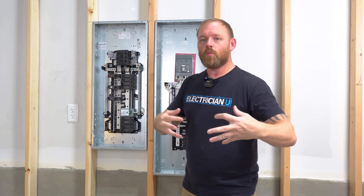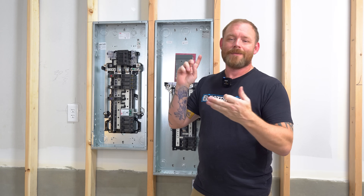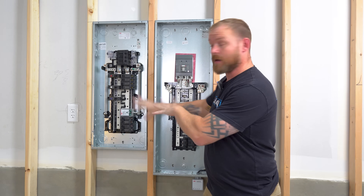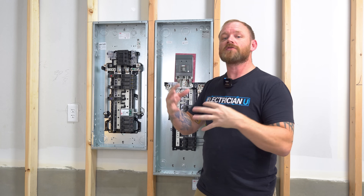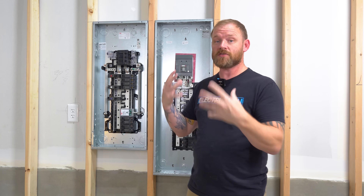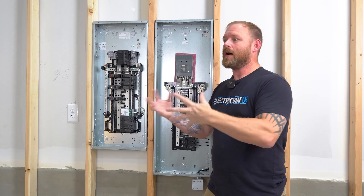Some other things that might be inside one of these are inductors, chokes, and high-frequency capacitors. Some designs also filter out unwanted frequencies — high-frequency events can happen through a surge, and there are other components that assist with that beyond just the MOV.